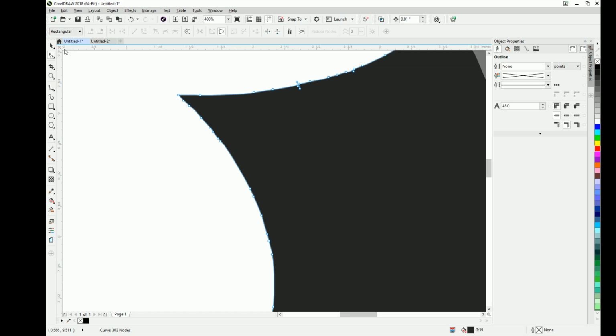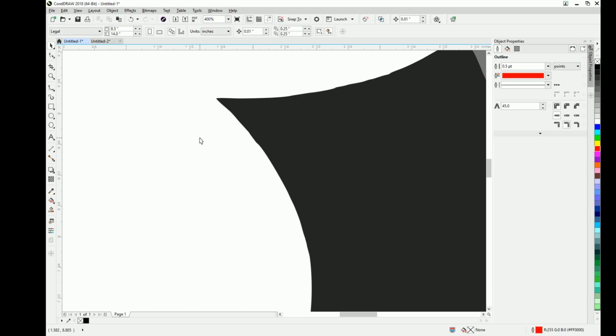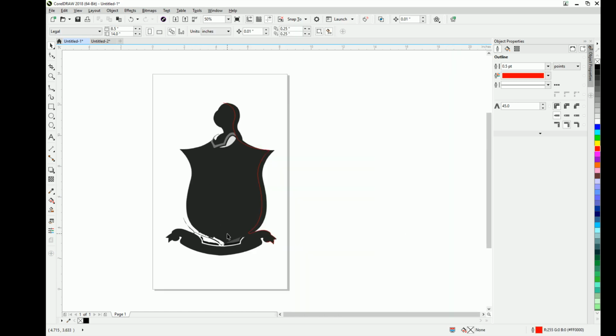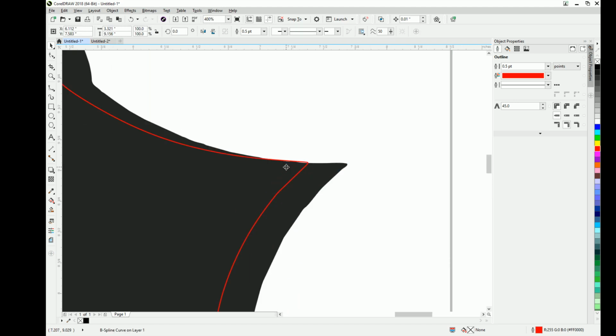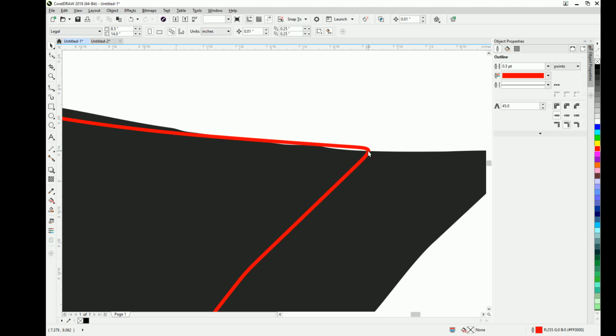So this is not showing my path, it's showing, so there's my path there. Now just for simplicity, if you notice here how the line is kind of round. Well, if you don't click twice in that area, it's going to be more like that, because these 2 points are trying to find a common radius to follow.